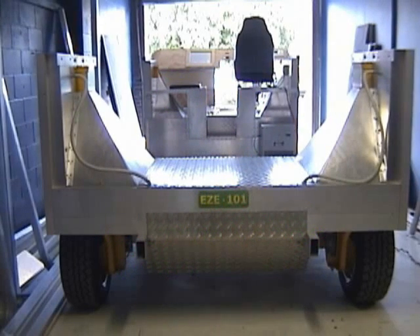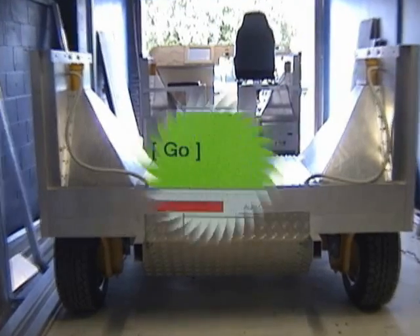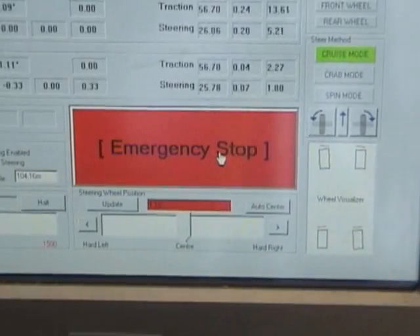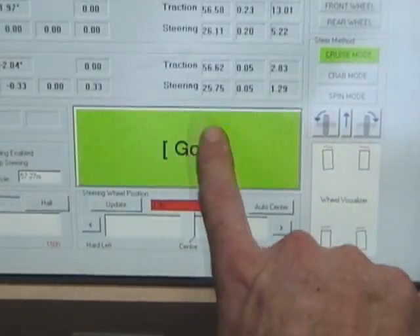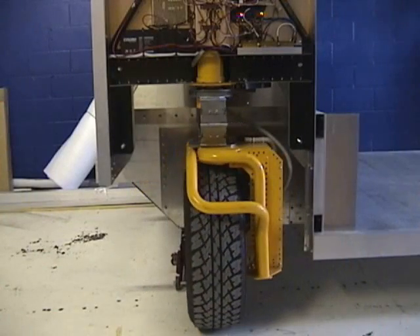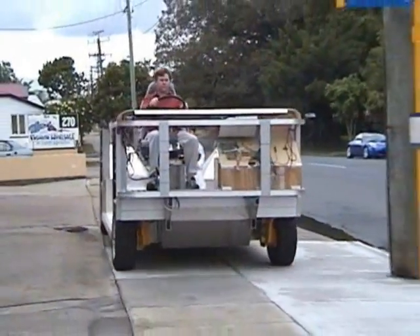The core of EASE technology is a systematic method of controlling the speed of rotation and angle of steer of each wheel. This is all done under the control of the main computer in the driver's console. It is our algorithm in the main computer that makes the wheels smart. Instant by instant, the computer sends unique commands to control each of the wheels.